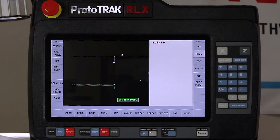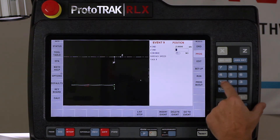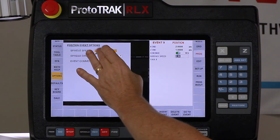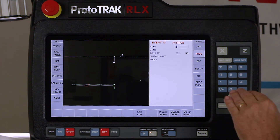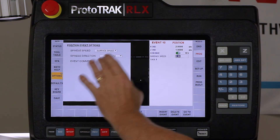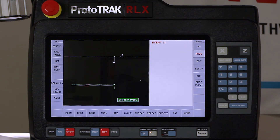After the groove I'm going to add another position move to make sure the tool gets out of the hole before it tries to go home. I'll go back to two inches and one inch, set continue to yes, and change to 200 RPM with tool number two. Then for threading I'll add one more position move for safety, again going to two inches and one inch clearance with continue set to yes. This will be tool number three.